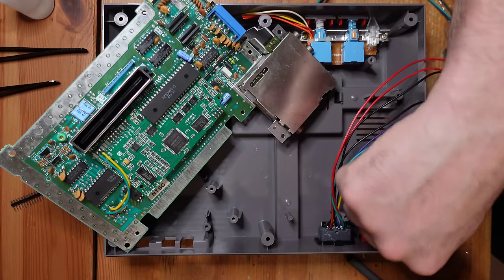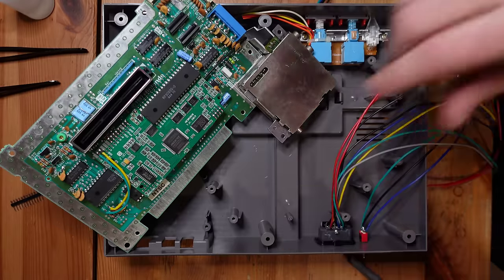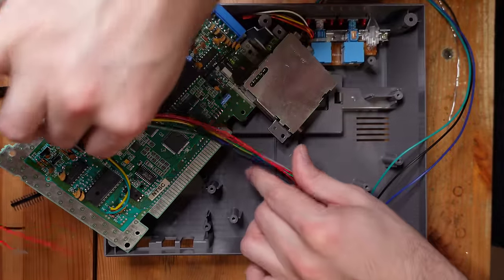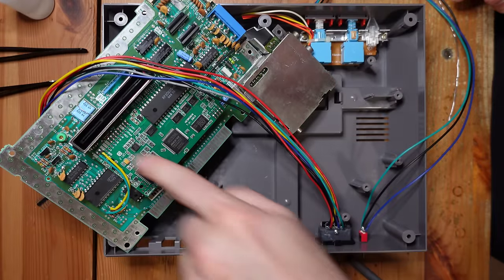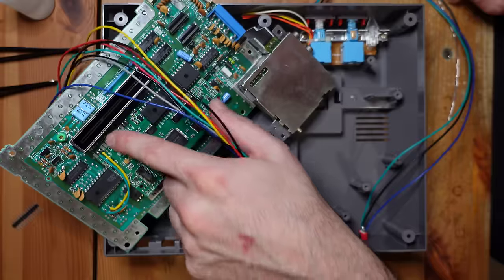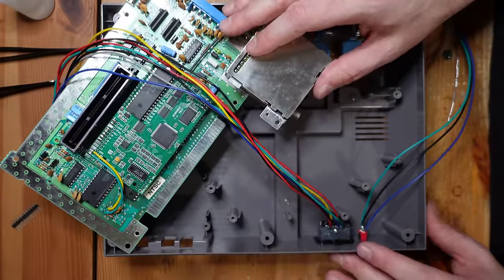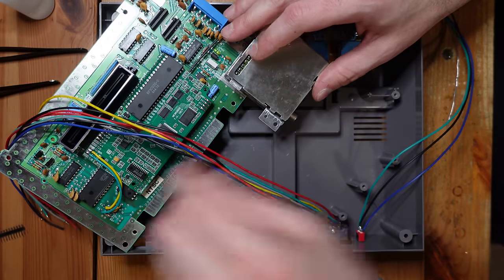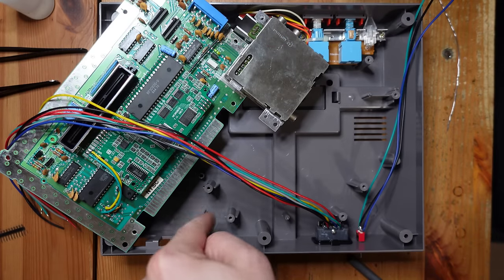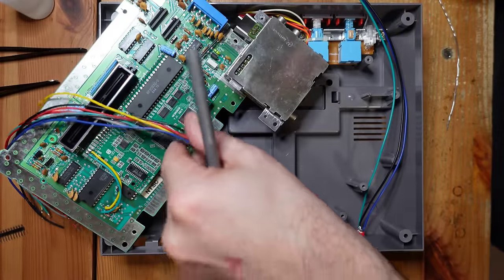You just add this final screw to lock everything into position. Now the last thing is to wire these up to their respective pads on the NES RGB. I've already pre-tinned them. The wires are about 10 inches, which allows you to rotate the board and put it back in its correct spot. I leave the palette switch wires rather long since the switch ends up on the far end and you need slack. Now let's solder in the multi-out.